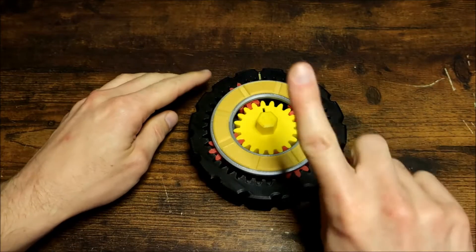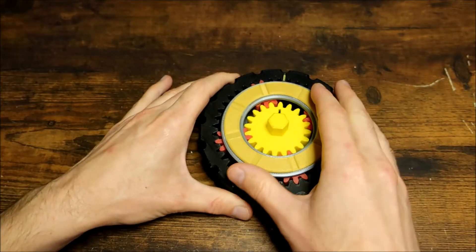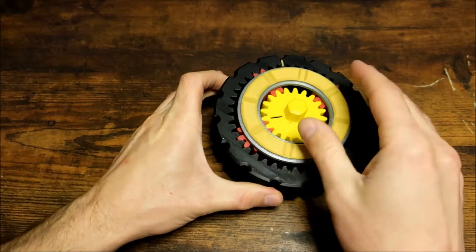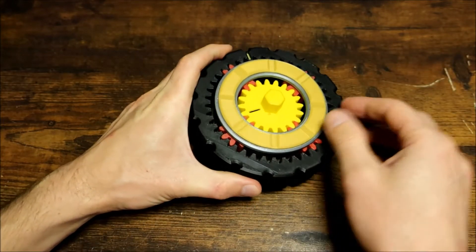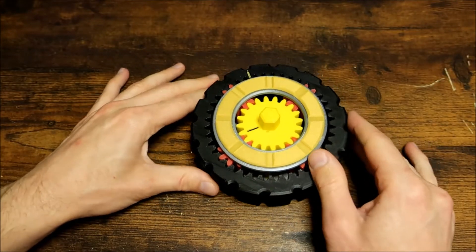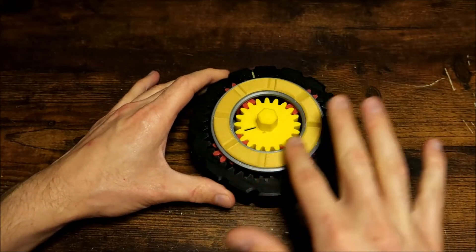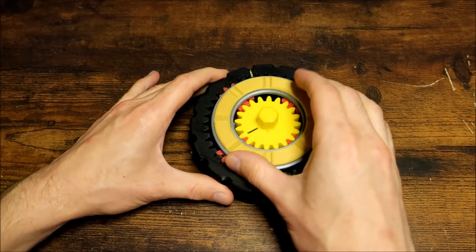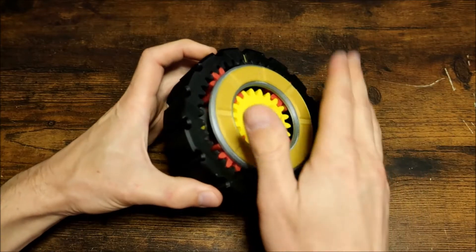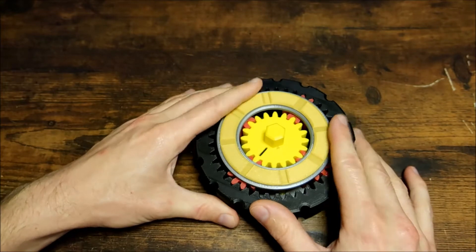Metal against metal is a bad thing. So with transmissions, a lot of times what you'll find is there's a lot of thrust forces generated. The natural rotation of gears, especially when they're helical — not so much these spur gears — generates what's known as axial or thrust forces. So you need these thrust bearings to control those forces. You have a type of bearing surface here which is the wear surface, but it's a softer metal designed to reduce that friction and control those thrust forces without allowing direct metal-to-metal contact.